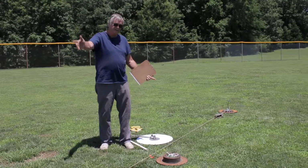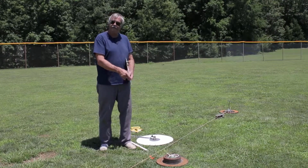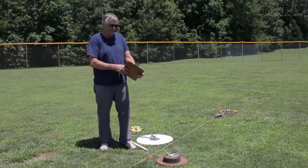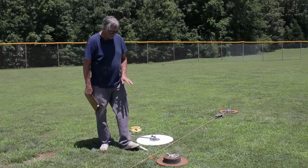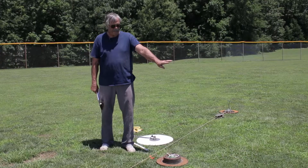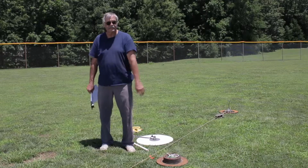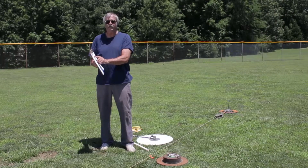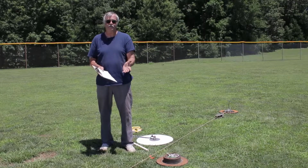Now that we have finished establishing the center line and we've marked it with ribbon and a nail every 10 foot all the way down, I'm going to begin placing these rotors dead over top of that, inserting the pole, the compass, and pulling the tape line out 90 degrees that way, 90 degrees this way. And I'll be using the dimensions on this table right here so that I know how far to go, and it's by scale of what's on the drawing.